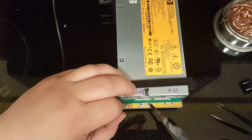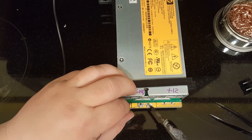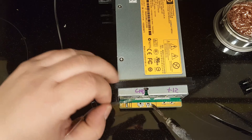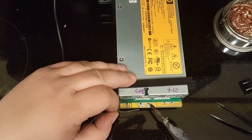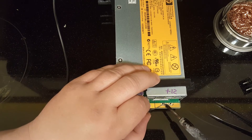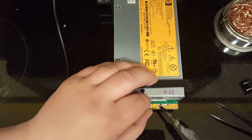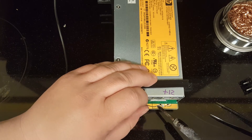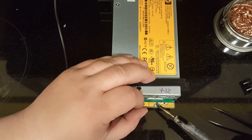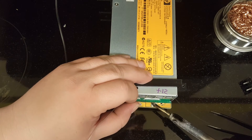I'm sure that if I gave it some time the tin would melt, but it's just kind of tricky. I'm hoping that as I solder these connectors from the bottom there will be enough heat to melt the upper layer of tin and make a connection on top as well, because I won't have access with my iron to the top once I put the connectors in. This is a 30-watt soldering iron so it should be able to heat up this PCB, but it's having a little bit of trouble.